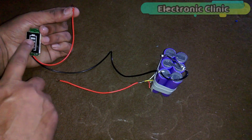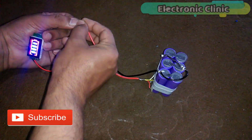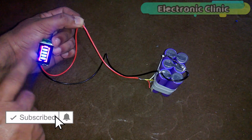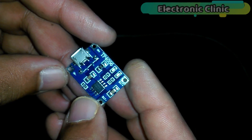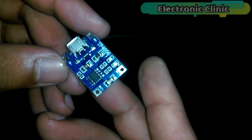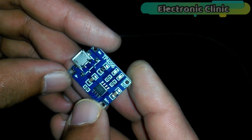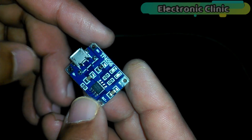As you can see, the battery voltage indicator ground wire is connected with the ground wire of the power bank, and the positive wire of the power bank is connected with the positive wire of the battery voltage indicator — the display is turned on. This is a 5V 1A, 3.7V lithium cell battery charger TP4056 mini USB module, which will be used for charging the power bank. Input voltage is 4.5V to 5.5V, and full charge voltage is 4.2V. This module has two LEDs as indicators.